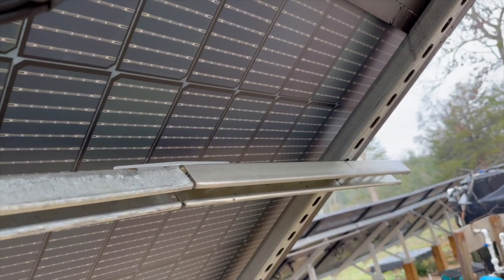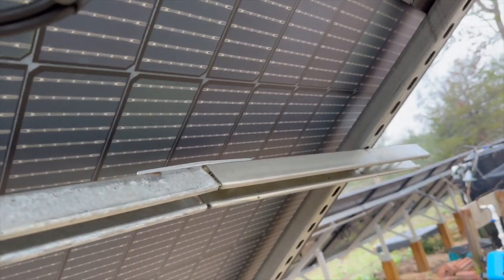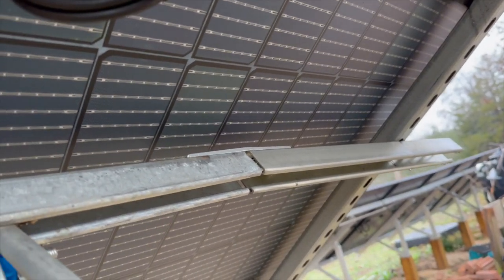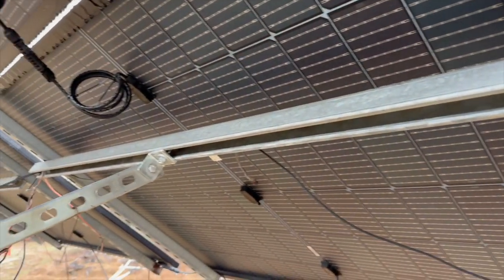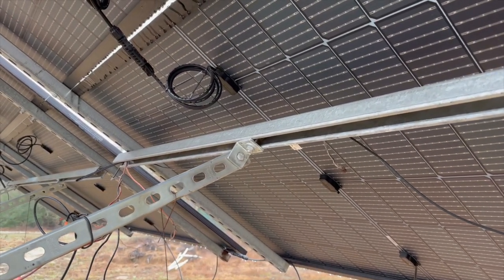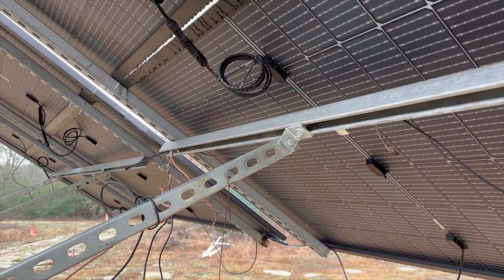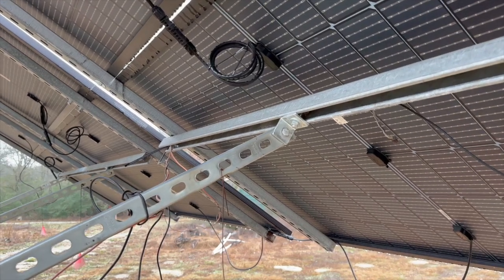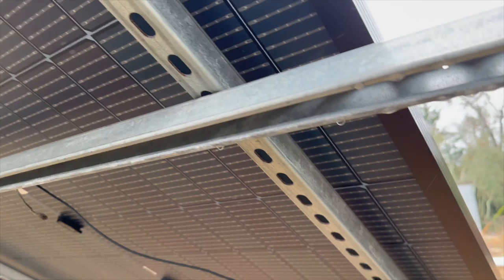The bowing is making the lower corner of the panel tilt a little bit. My advice is if you're going to use 12-gauge unistrut to support all these panels, I would use 20-foot unistrut. They do make it — you've got to go to an electrical supply to get it. Cut it down to size and you'd have plenty of places to use the extra.